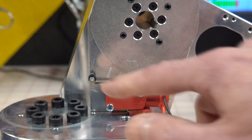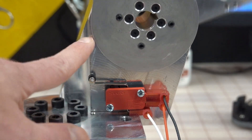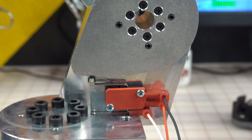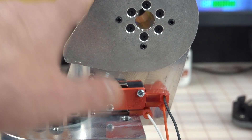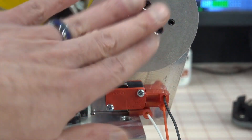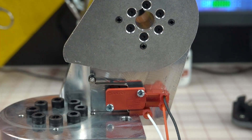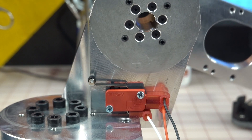Now that it's mounted, here's what it does. We have this big ring here with the lobe on it, and when that lobe comes around it actuates our limit switch. So it's a cam system here. This plate is a retaining plate and it applies tension to preload the J2 bearings, but it also gives us a cam. Cool.